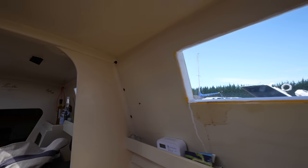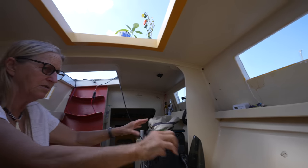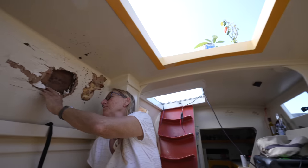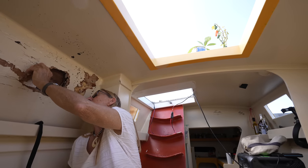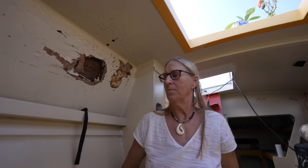You've got a plywood outer skin, probably 9mm plywood as per design. And then the stringers. And then he's filled in between the stringers, I think, with polystyrene foam pieces. And then he glued a thin layer of plywood on this side, which is probably only 3 or 4mm plywood, which you can see here. So you have got insulated hulls everywhere. That's really nice. Because on our Iceland trip, we only had 9mm ply between us and about 3 degrees water on the outside.